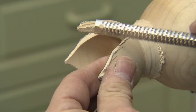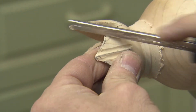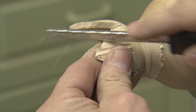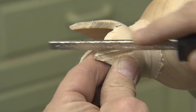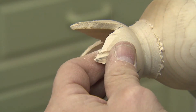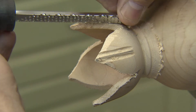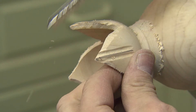That will make the leaves look a little bit more delicate, a little thinner than they are right now, because it's all an illusion here. We left this about a little more than an eighth of an inch thick for strength. I'll round this down now, and then when I start using the carving tool to add texture, it'll be a smoother transition between the two cuts. You can even use this tool to come in with an angle and smooth out the transition between the two leaves. We're after texture more than we are art here, which is a good thing for me.